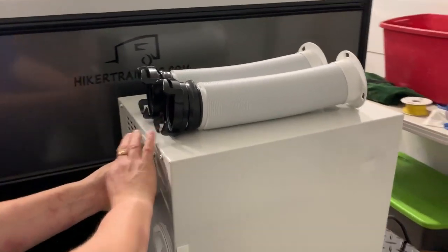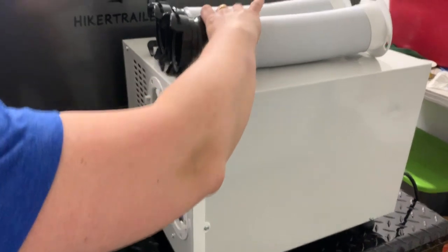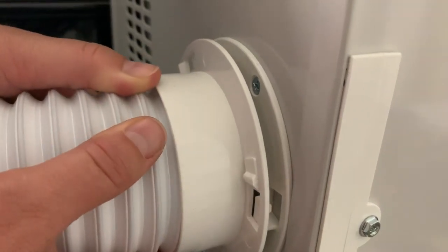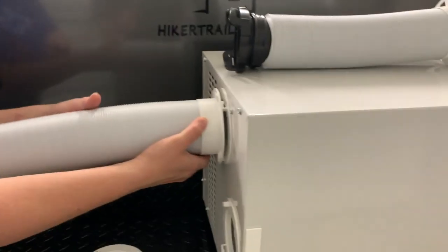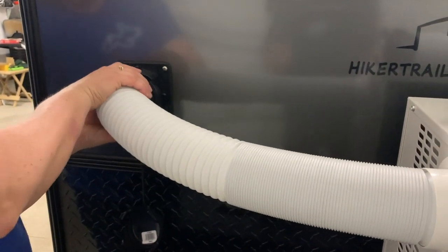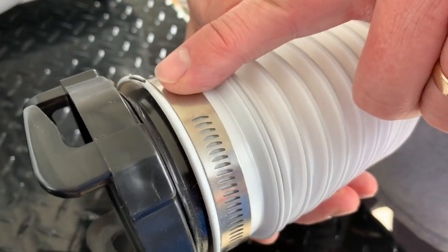So let's do a walkthrough of the setup. Basically, you take the covers off your hiker. I prefer to have the cold side — where the cold air is coming out — be the shortest run to the trailer, because you'll have less condensation. It will condensate on the hose and the hose can start dripping if it's a humid night. You just unscrew it, give it a quarter-turn twist, and lock it right on.